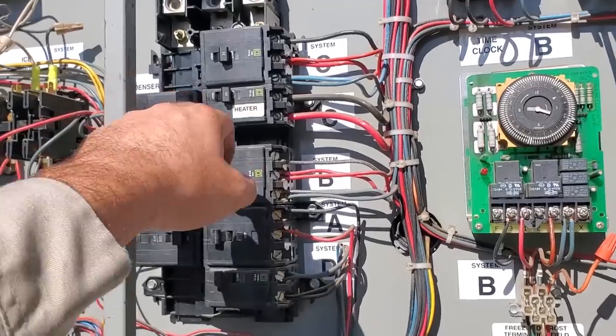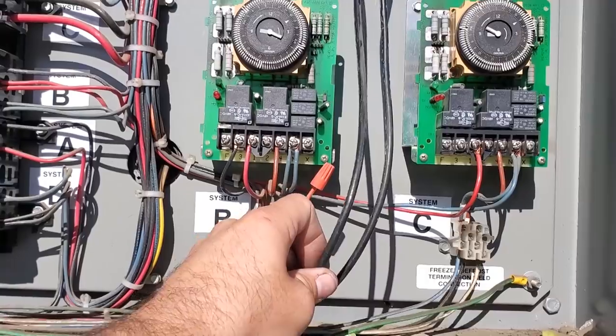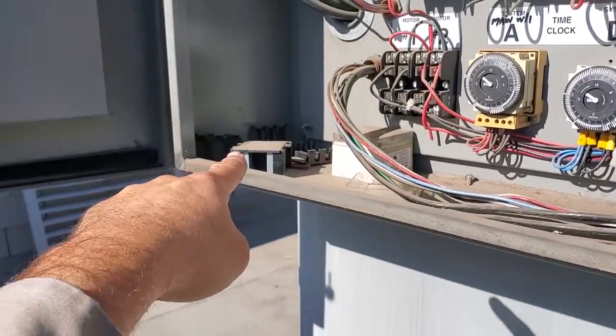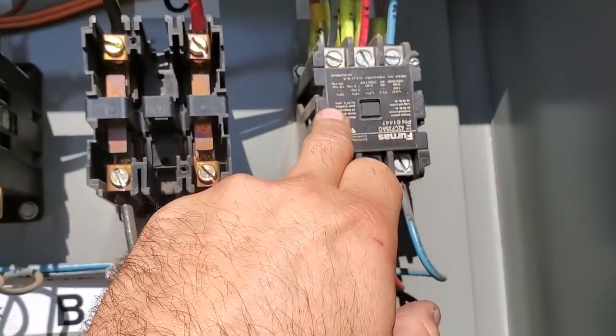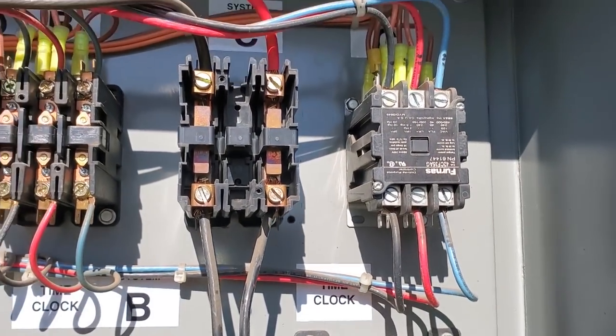When I am done, I will write 'not in use' on everything that's dead. We'll go ahead and pull these wires that were going downstairs to the heaters and cap them, and put the covers back on and write 'not in use' on this one. I'm going to open this up — I bet anything that contactor is hit, so we might be changing that. But we'll see.